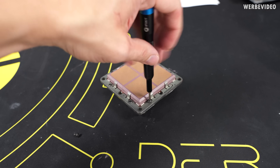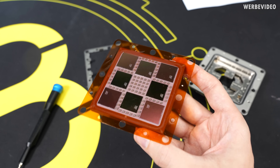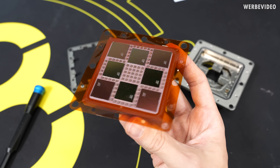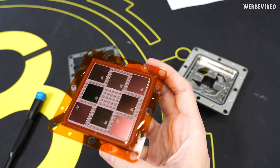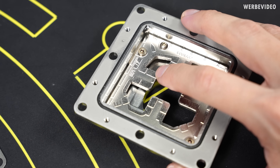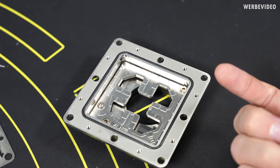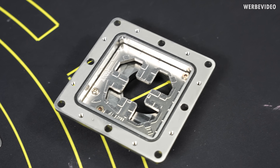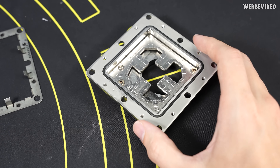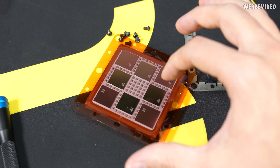After removing the screws on the outside, that's our supercomputer CPU. I'm not quite sure if it's an eight-core or four-core CPU — we have at least eight dies; it could also be four cores and four cache dies. Around it there's some kind of gasket to seal it off to the case. Now here you can see all the fluid nozzles — tiny holes positioned to direct the fluid directly onto the chips. This has to be super precise: the amount of fluid, the pressure, the direction, and the number of holes must be perfect to ensure all chips are fully covered by the mist.